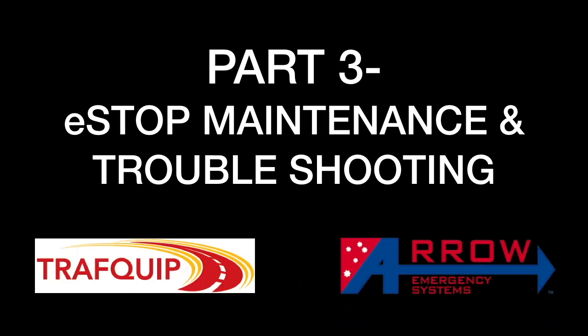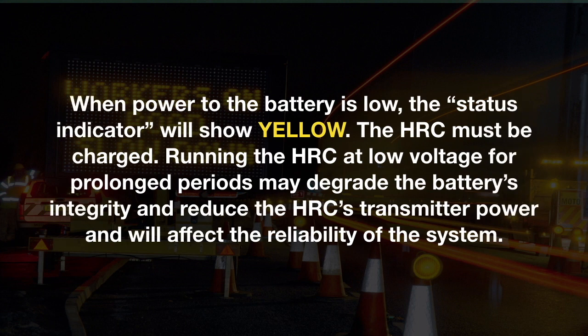Part 3. eSTOP maintenance and troubleshooting. When power to the battery is low, the status indicator will show yellow. The HRC must be charged. Running the HRC at low voltage for prolonged periods may degrade the battery's integrity and reduce the HRC's transmitter power and will affect the reliability of the system.